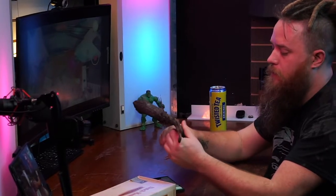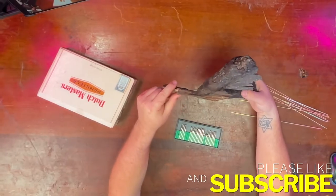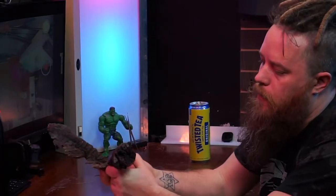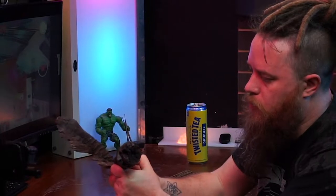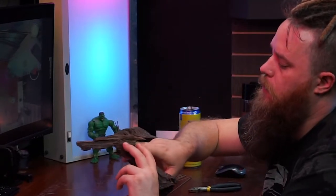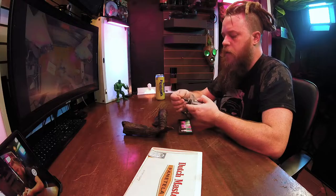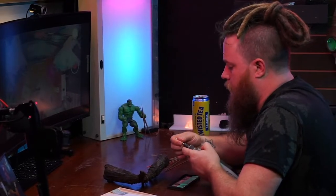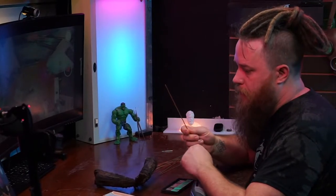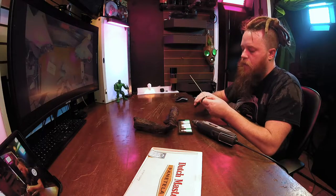I finished doing all of the stuff to it. Next I'm going to find my spot to drill for my rod, which is kind of difficult on this piece because it's very thin and it's got some funky angles. I'm going to have to go in right about here and try to go straight. Because if I put the bit on and try to get the angle right, I'll be hitting the chuck on the side of the piece. Instead, I'm going to take this piece of brass tubing, cut it down to the length I need, and use it to drill my hole.